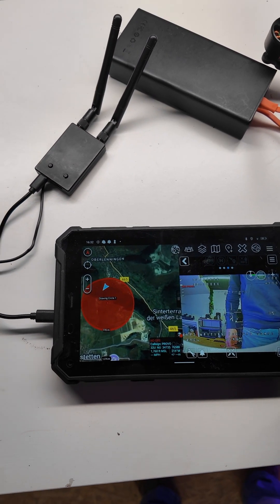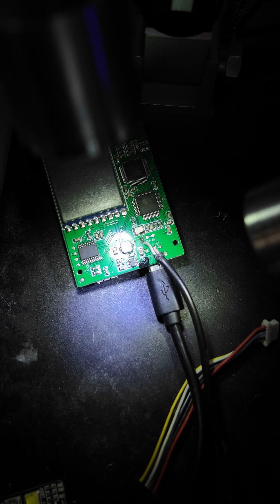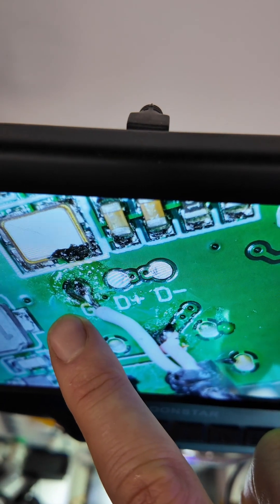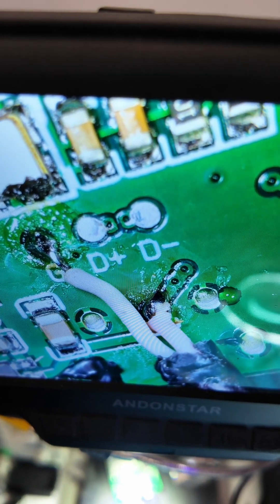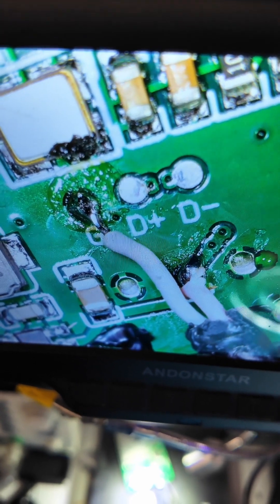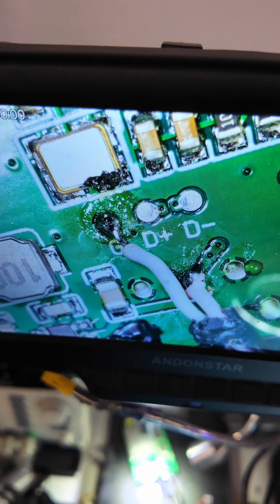Here on my microscope you can see there's a pad for five volts and ground, D-plus and D-minus — that's for USB-C — but you just need the power pins. That will feed it, and you can then directly disconnect the power source afterwards. You're good to go.